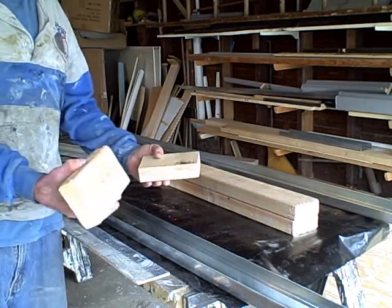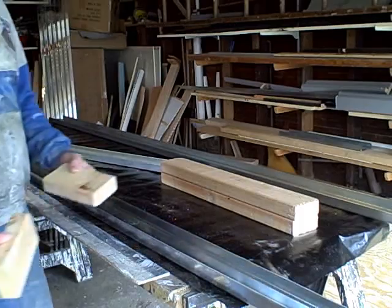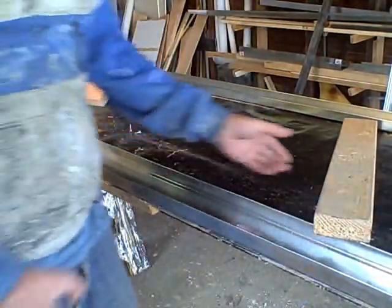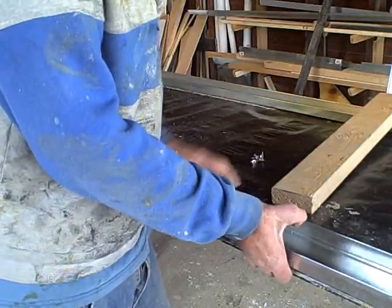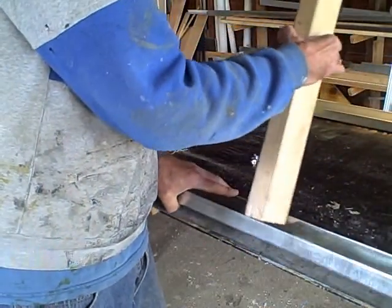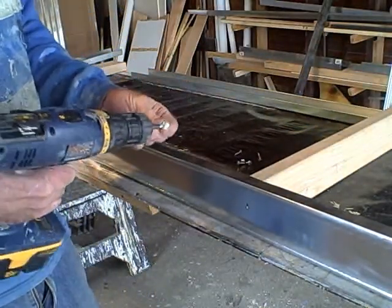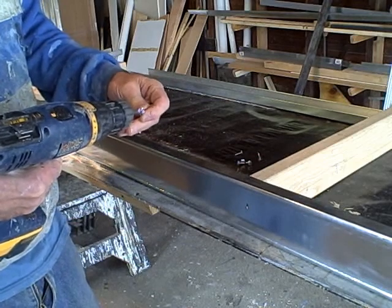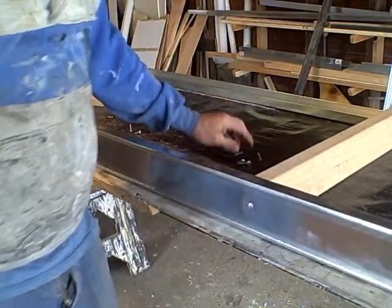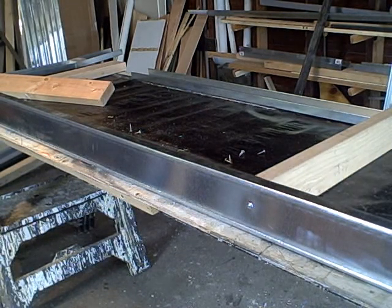While you're doing that, you can also cut yourself a couple of blocks about six inches long. Then let's set up our temporary support for our stud slots. I've already pre-punched the hole here, and this is our spacer at 25.2 inches. We'll just set that up like this, centered, with just one screw — this is just a temporary support to hold it in place while we work. The studs and the stud slots go together really well.